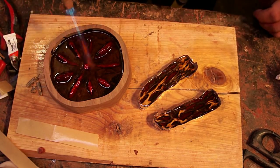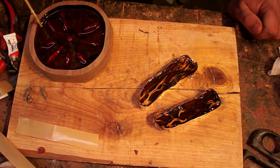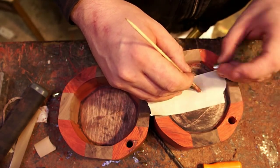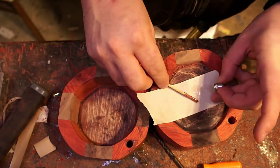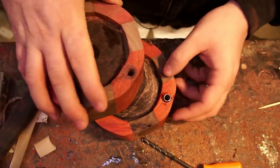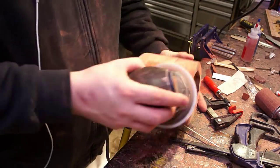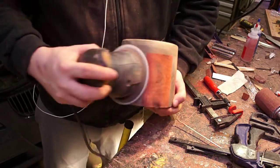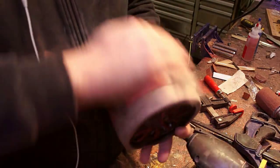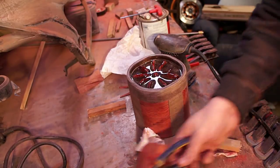After I poured the epoxy, I light up the propane torch — you can see all the bubbles popping right when I go over it. It makes it a bit clearer and easier to see through. That takes a little while to cure. While that was curing, I noticed these holes I drilled up through the body weren't the exact same size as the threaded rod coming up through the bottom, so I wanted to positively locate them. I figured the best thing I could do was put a little metal spacer in there so there wouldn't be any misalignment as you're opening and closing the pieces. With everything basically done, I put the threaded rod through, tightened everything down, and went through with the random orbital sander getting the finish right and making sure all the little gaps were correct. I went through the grits — the last grit on the random orbital was about 320, and then I went from 400 to 600 by hand.